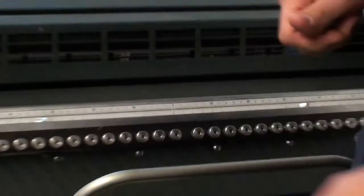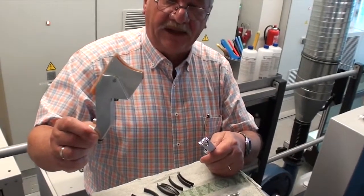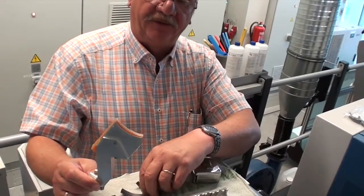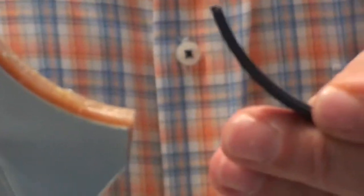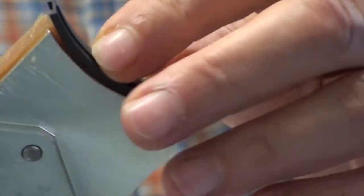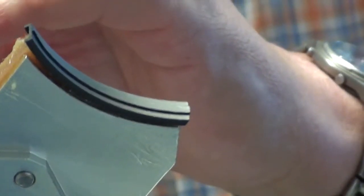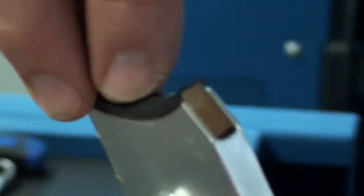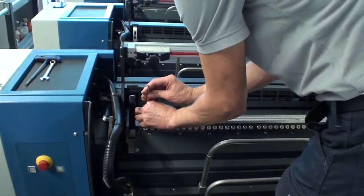So, Mike, you're finished? Yes. So now comes back to our ink dividers. You see here, this is our ink divider, and on the peak of the ink divider we will put a lip. It's made out of Teflon and plastic material, and we will put it on top of the ink divider. This is then in conjunction on top with the roller. Okay? Mike, please go ahead. Moment, it's not the right direction. So, as far as the width of the lip is concerned, we selected the very small version, which is 3 millimeters only.